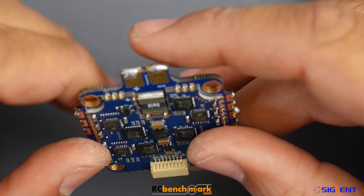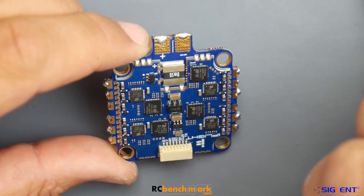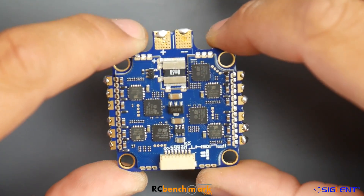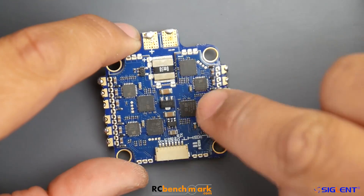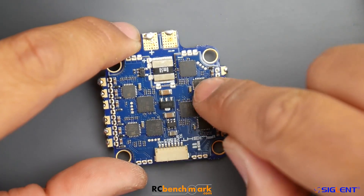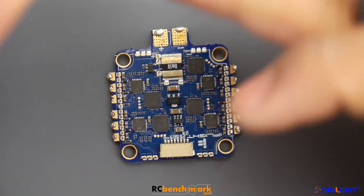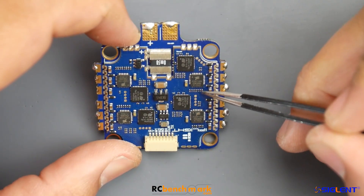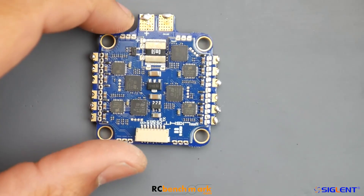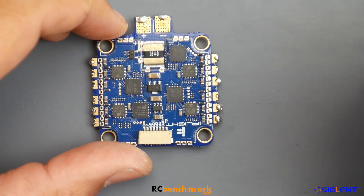You must add a low ESR capacitor - it was pretty noisy, and we'll get to see that in a bit. I was wondering how they're reading everything on 6S into the FET driver, because the FET driver takes a maximum of 25V to sense each phase. If it exceeds this, you shouldn't really go over 20V on the FET drivers. But when you look closer at 6S ESCs actually rated for 6S, they show a voltage divider for each sense pin - that drops the volts kind of like a mini step-down regulator, and you can actually see those voltage dividers for each sense pin here.